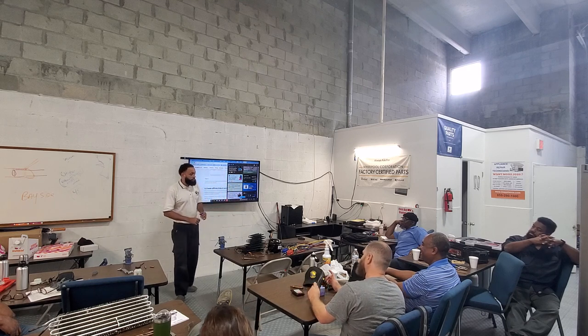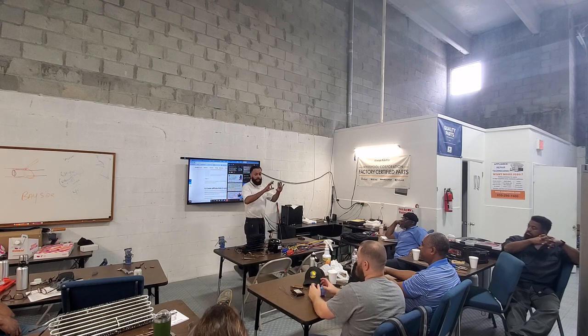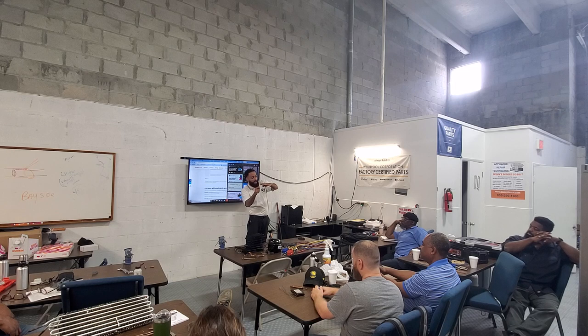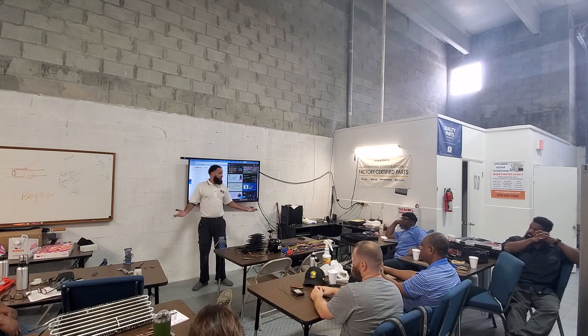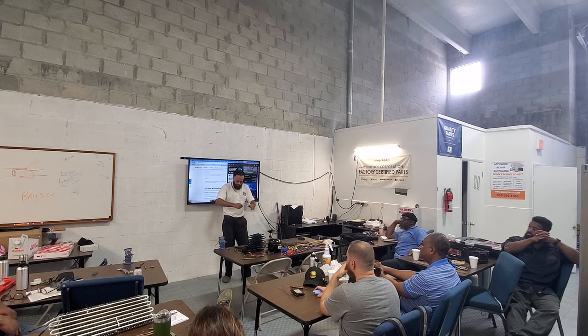We do an X pattern. A little bit here, a little bit there, a little bit here, until that thing is tight. Now, I've tried to think I could do it tight, and what I ended up doing was I tightened it so much, I started seeing the suction of the process line actually bend. Because I didn't want to bend and, you know, break the tube. So don't go crazy with it, but until it's snug. Okay? We all know what snug is. No movement. You mess it up if you want to. Do it right.